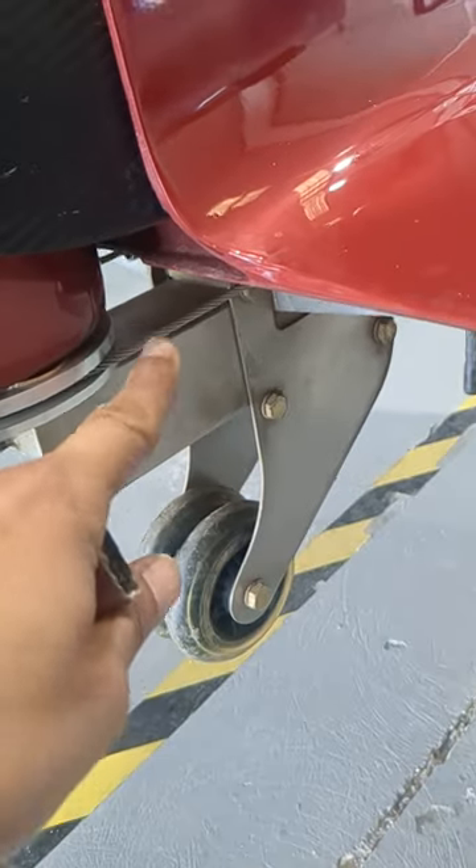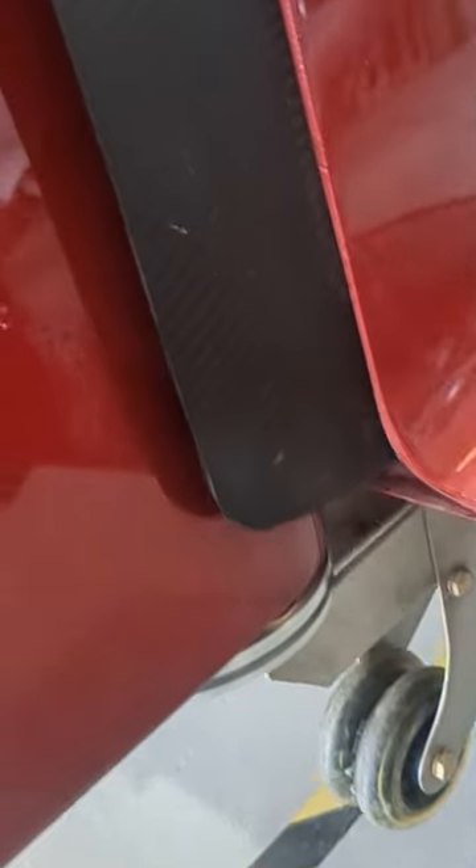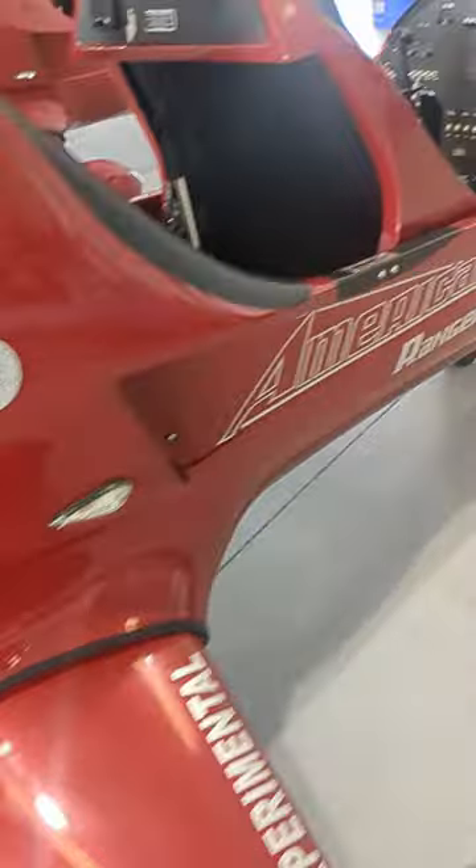The rudder is attached to this pulley — you're not going to take the pulley off from the rudder, you're just going to loosen the tension in this cable. To do that, come to your right-hand side under the back seat, and you'll see the turnbuckles — safety wire turnbuckle. You need to take this pin out — that whole pin, not just the safety pin — so the rudder cable is loose. Cut off the safety wire, mark the turnbuckle with a Sharpie, and turn it loose about four turns. Count that and write it down.